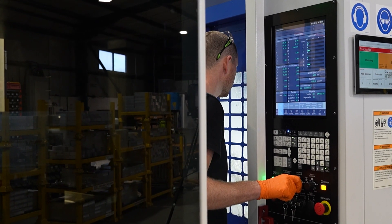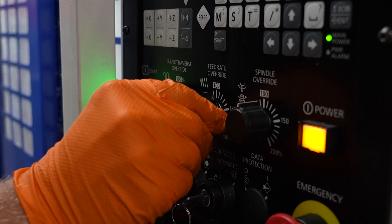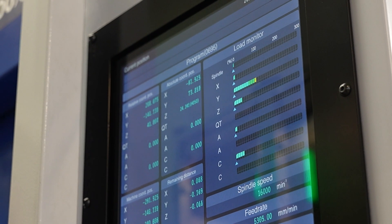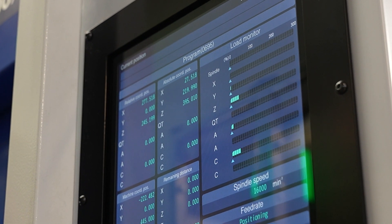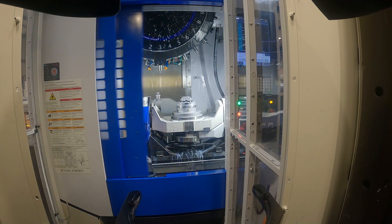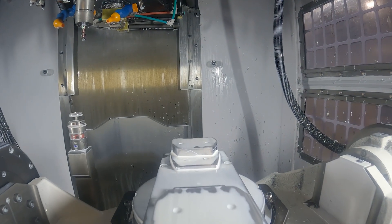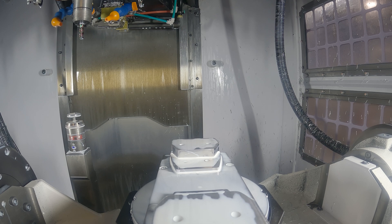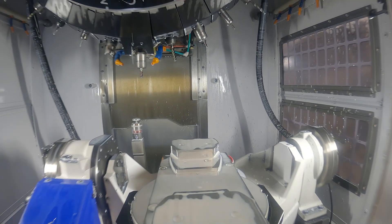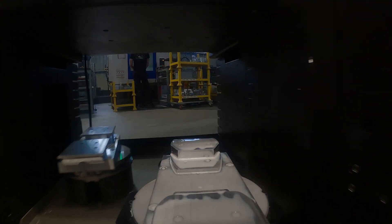This is the newest in a wide range of Brother machines — the U500 XD1. Many years ago we started out with another brand of machining centres, then decided we needed to be more efficient, so we bought a pallet changer as our first step into Brother — a very efficient machine with a three-second pallet change. Since then we've been buying more Brother machining centres and their Feedio automation systems. The Feedio could only supply op 10s into the machine, with op 20s done manually, so we bought this machining cell to do op 10s and op 20s all in one and get completed components out.